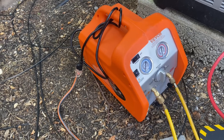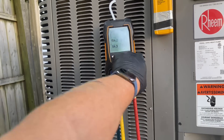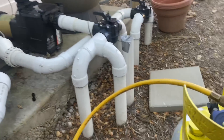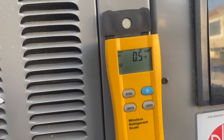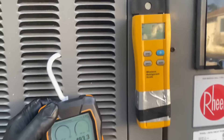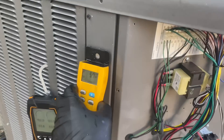Tough tools, half the price — I call them the Harbor Freight tools for online. It has its pros and its cons, but it works. I'm going to open up my high and my low side valves on my manifold. We're going to open up our charging hose and we're going to purge out the air — there we go, beautiful. I already had zeroed out my scale. We're already at positive 0.5 pounds that we've taken out so far. Recover fast, power's on, let's go. A few minutes already into recovering, we took out 5.7 pounds already.